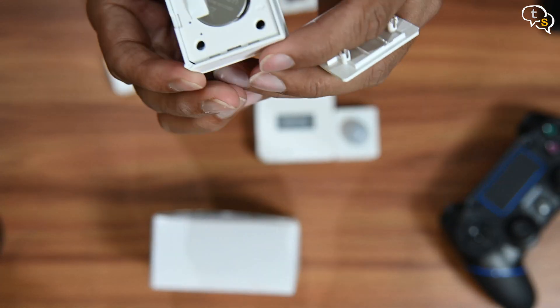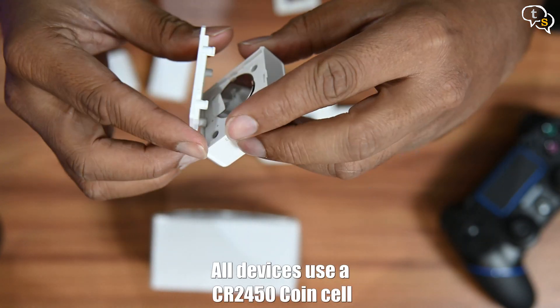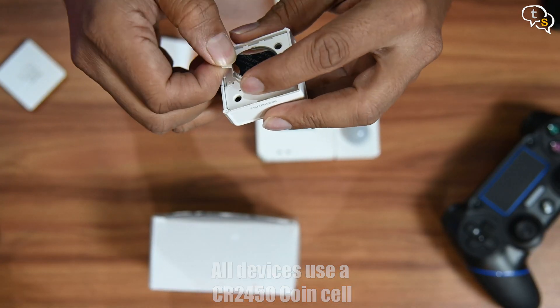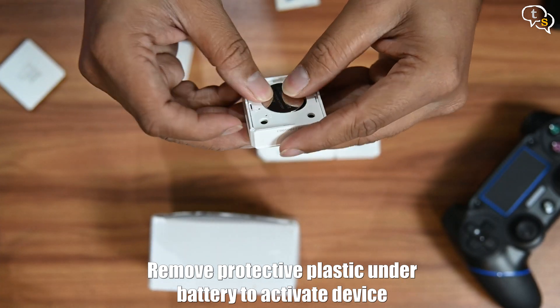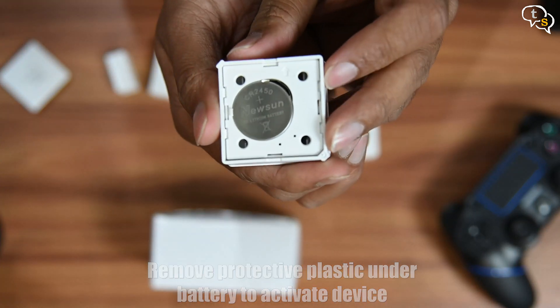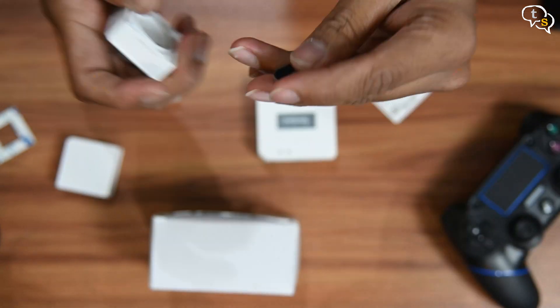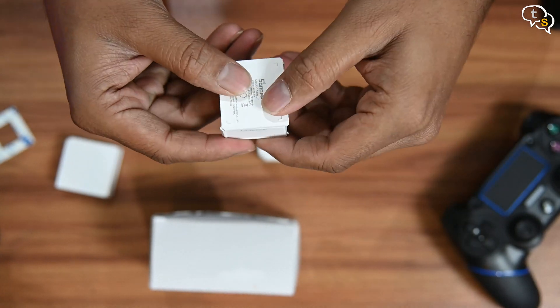We need to get these devices ready for pairing. So for the Wi-Fi switch, you need to open up the backplate and it uses a CR2450 coin cell. Notice that the cell has a plastic sheet below — just pull it out and the device is now powered on. The same for the other devices. I just wish they made it simpler to open. I'm worried when the time comes to change the batteries while mounted, would it still be easy?